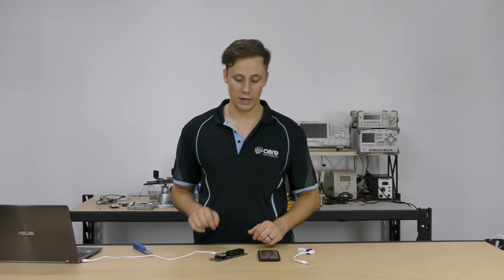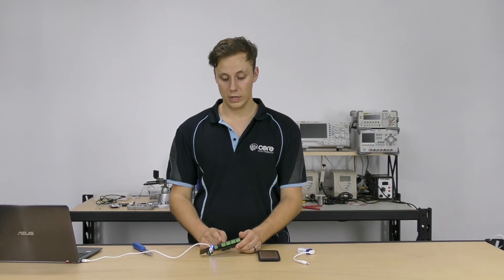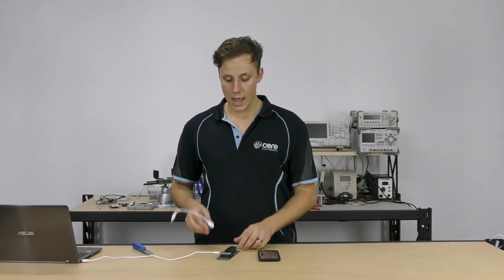This board is as simple as plugging your Photon in - the circuitry on board takes care of any logic level conversion and you just write a high to the digital pin and the relay will turn on. Write a low signal to the digital pin and the relay turns off. Particle have released a library for the relay shield, but in my opinion you're better off just using it as a digital output and using a variable to name the output pin. The library doesn't really include any extra functionality because it's such a basic idea - all you need to do is turn a pin on and off. You can do that easily in code just as you would turning an LED on and off, and you'll save the overheads that come with compiling that library onto your Photon board.